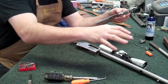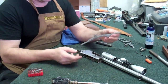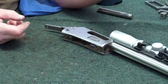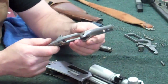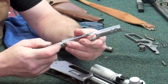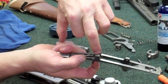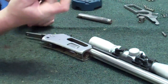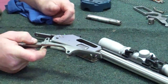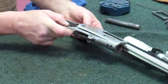We're going to kind of skip through reassembly, but there's a couple of little tricks that maybe you might need to know. You've got your gate back in, your carrier back in, and your locking block. I've slid the hammer back into place and I have the holes lined up. When you go to put the tang back in the bottom, you'll notice the trigger doesn't come all the way back. What you might want to do is push up on this and pull the trigger all the way back — the hammer has to fit down inside this notch right here. If you don't have your trigger all the way back, the sear's not going to be in the right place to get that hammer back in there, so it's going to be a little bit tough.